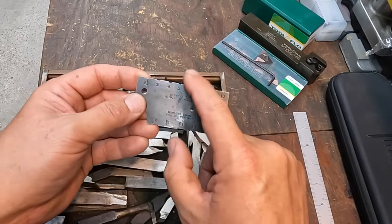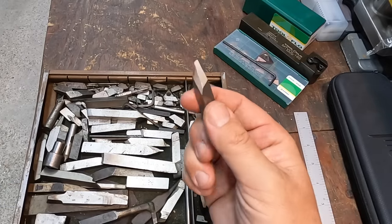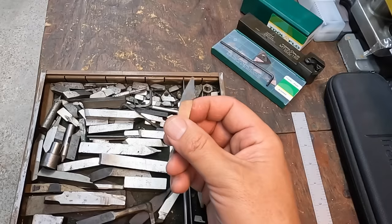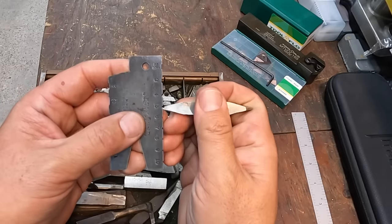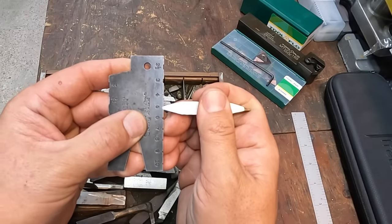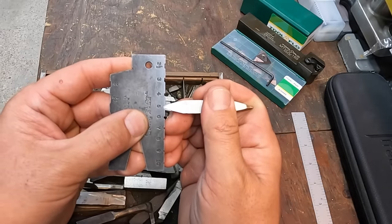So use this gauge right here to hand grind, or if you want to use a tool grinder, your Acme tool out of a piece of high speed steel. And this is what many people have done throughout the years. So you'll grind the tip of the tool to match. So there's the number 5 right there. The width of the tool should match the width of the groove up there for that thread pitch's designation.